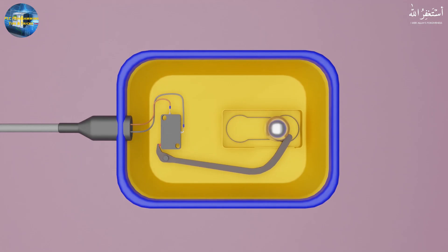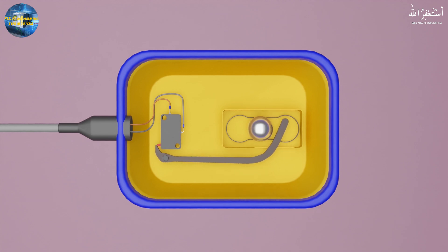The micro switch's normally closed contact opens. When the water level rises, the float switch moves upwards, the metallic ball moves backwards, it releases the lever, and the micro switch resets again — its contacts become closed again. This is how the micro switch operates inside the float switch.